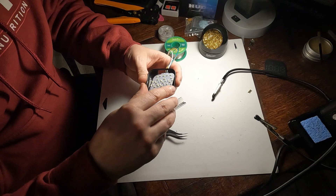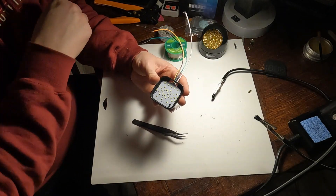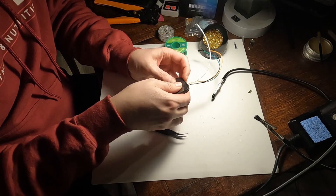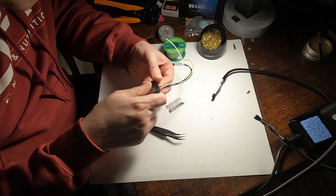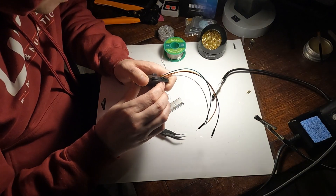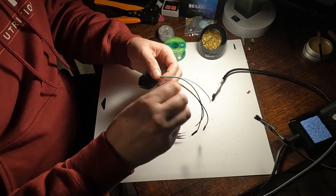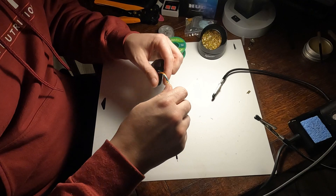At first I had it upside down, but you're going to want to make sure that the LEDs are facing up so that once you put the cap on, it'll actually read through. I would recommend using a notes app or labeling your wires — make note of which one is left, which one is right, which one is down, and which one is ground. If you're looking at the back of the unit, the metal lead all the way on the left is actually right, because you're doing the wiring from the back. Down is the one that is furthest down on the little module. Ground is in the middle at the top. And left is actually all the way to the right. Just make sure that you know which is which so that when you go to connect everything, there's no confusion at all.